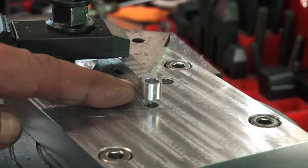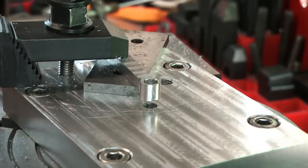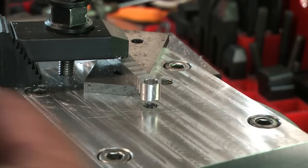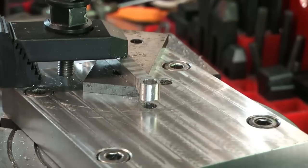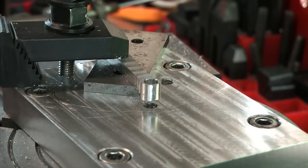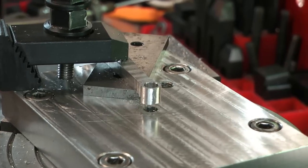I've got to a point now where I've gone all around the periphery at the right size. I measured up across — it's meant to be 375, it's actually measuring 372, but I'm not that worried. There was a tiny flat on the end where the hole wasn't quite the exact distance from the end, or I over-machined a bit too much. I just gently blended it in with a needle file. It's all going to be polished anyway, so that'll be fine. I need to do this full circle now, so I've changed my DRO to incremental so I can move off that reading but I've set a zero — that zero setting is the finished diameter that I was turning to.